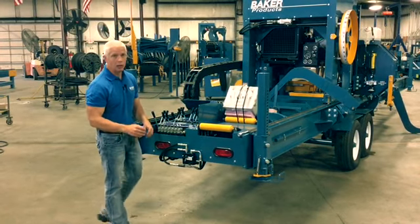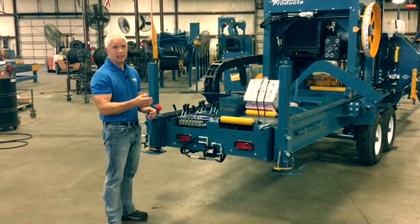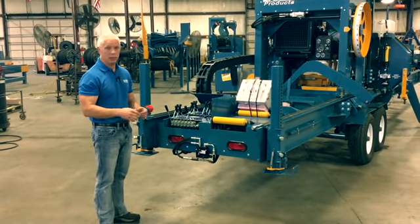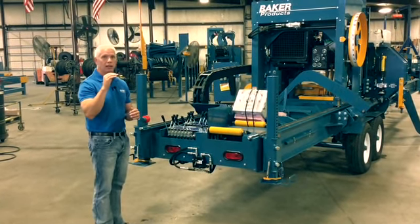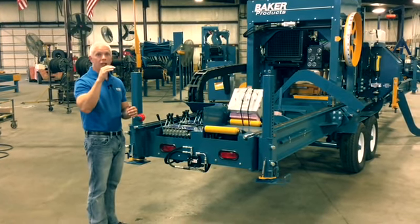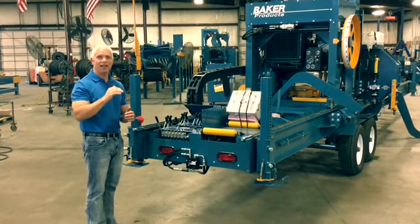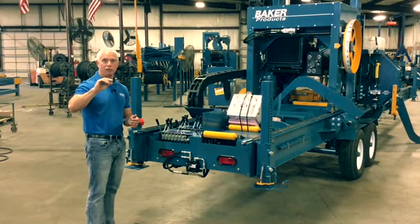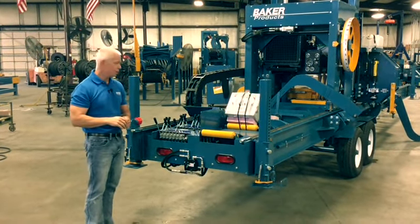4 settings allow you to make a couple cuts on the log, get to that third face, and tell the machine basically you want to make a 7x9 tie or a 4x6 cant, whatever it is you want to make. It will take the shim cut out of the slab, your outside cut, and then let you make the maximum number of 1 1/8 boards, if that's what you're making, down to that square size. When you get down to that square size, you won't have to shim cut it to size it properly. It's already taken that into account at the top side.